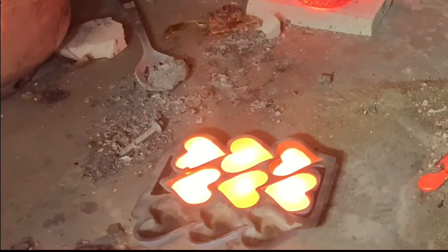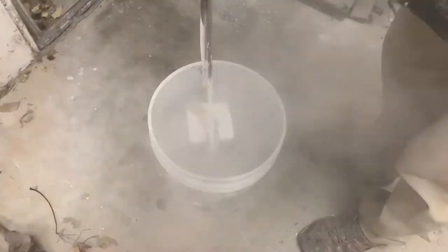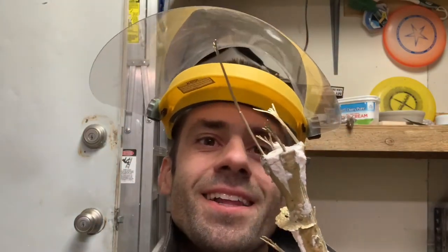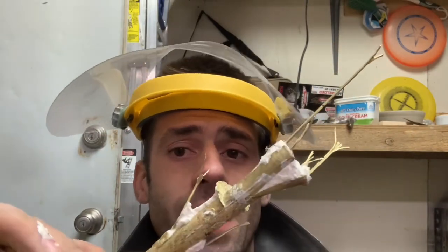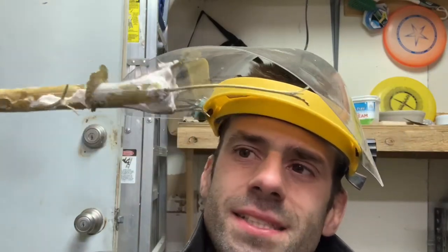I had way more than enough metal. Time to quench. I'll start with the one I don't think worked. I should have been a little more optimistic, but it's just a little beyond the limits. For something like that I'm going to need a vacuum or centrifugal caster. It's still kind of cool — just too small for the bronze to get in there without assistance. Now for the one that I have some cautious optimism about.